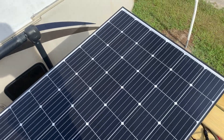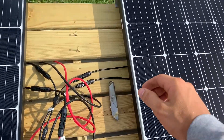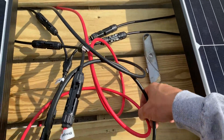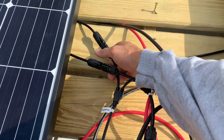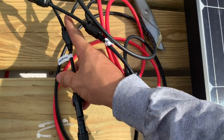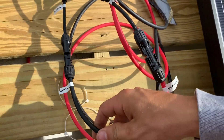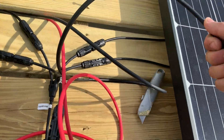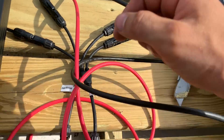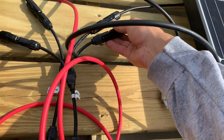It's time to wire these suckers in — I'm literally dripping sweat onto these panels. Before I tuck this all away, each panel has a male and a female end. I have these connectors which take both male ends and turns them into one female end. The black is negative, so I plug that in, and then there's 10-gauge wire that runs underneath — that's where this is going. Same thing for the hot side: two female ends plug into here. We're off and running.